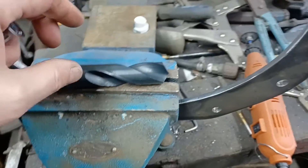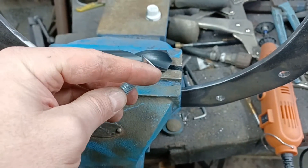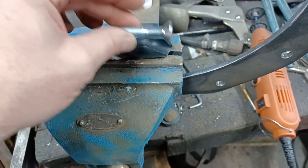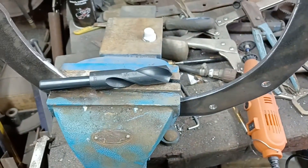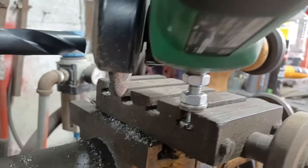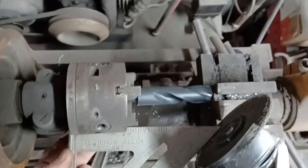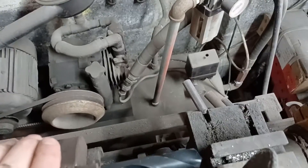Now that's not going to give me the bevel I need because the bevel on there is 45 and 45 - 90 degrees - and that's 30 degrees or something. So I'm going to re-grind that bit to 90 degrees and see if that'll do the job for me. Here's my contraption for doing that - simply use the bolt as a T-piece. I've got a grinder set up at a 45 degree angle to the machine and I shall grind away.